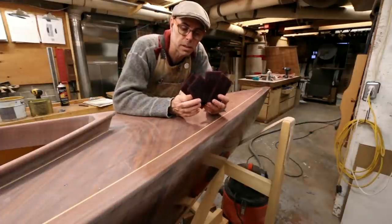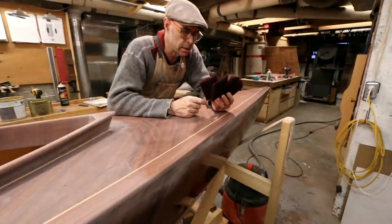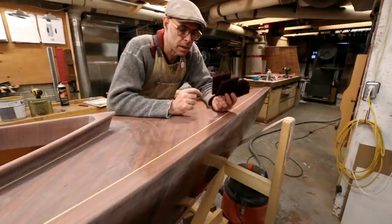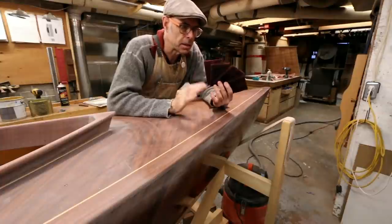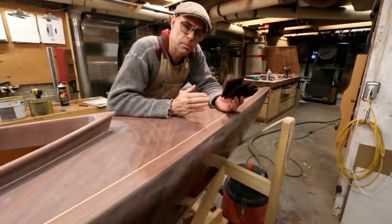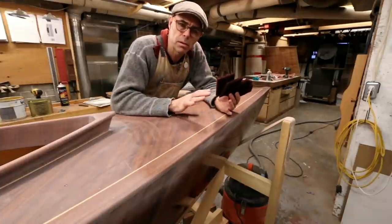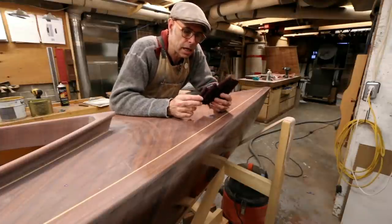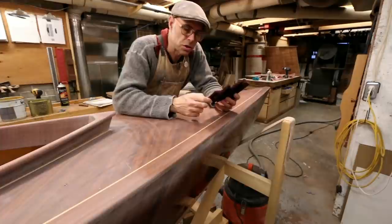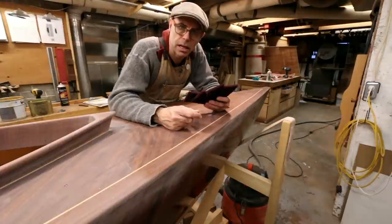I split them down into four or even eight pieces, so they're reasonably economical. I use these all the time, especially when I'm finishing and between coats. A lot of the time I'm trying to build up a finish — I don't want to remove material, I want to leave it behind. But I do need to make sure I get a mechanical bond between layers. Even if I'm working within what we call the green window, where there's a chemical bond that will occur, I still use one of these because when you de-gloss the surface, you can see what you're doing. If you try and paint wet onto a glossy surface, you really can't see what's going on, and it's hard to see what we call holidays — those spots that you miss.